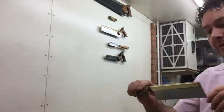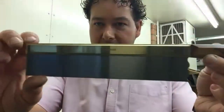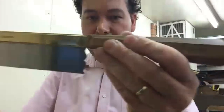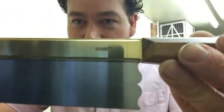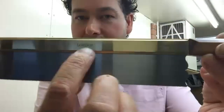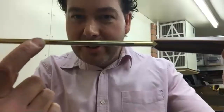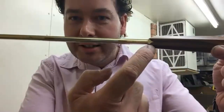And other saws that we've done, which I gave you a glimpse of last week, this is the Archer saw that we're making, which has a tapered octagonal handle. And also, you can see this detail in the back of the blade. If you look very fine, I don't know if you can pick that up, it says S. Skelton in here. It's stamped London. And then for it to be an archer, we've taken the Cupid bow, and what we've done on the back is have the back shaped like an arrow coming back into the handle. If you can see that detail there.